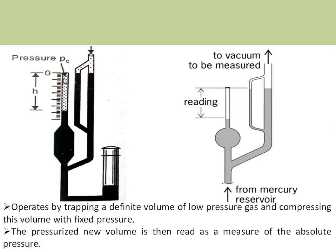After stopping, a certain amount of gas is trapped inside the measuring capillary. Whenever there is a higher amount of gas — meaning high pressure — more head is generated. Whenever the pressure inside the chamber being measured is very low, a lower number of gas molecules are present and the amount of head generated is correspondingly decreased.